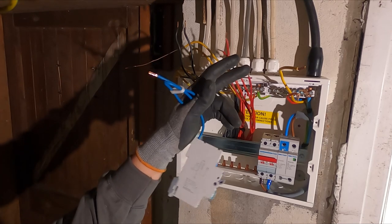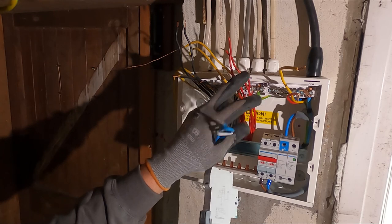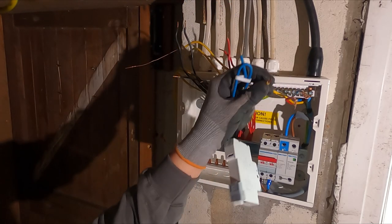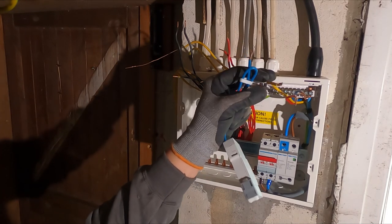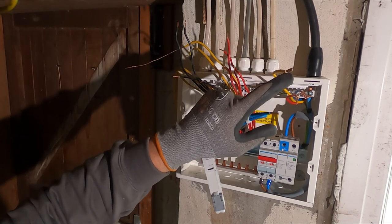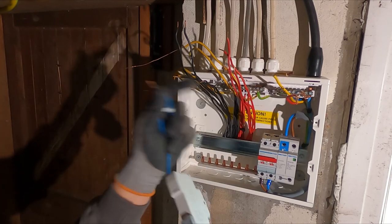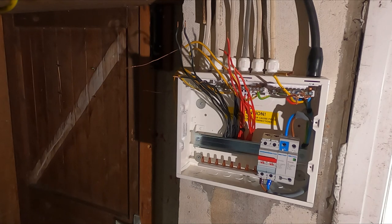And you also see people putting them on the solid cores. Ferrules are not for solid cores. Therefore, you know, your fine stranded flex, even like this SWA, which is like drawn copper. You know, some people call it seven strand and stuff like that. A ferrule, you wouldn't even put a ferrule on that. You'd want like a pin crimp or a pin terminal, reducing terminal sort of thing on that. Yeah, ferrules are really just for your fine stranded flexes.